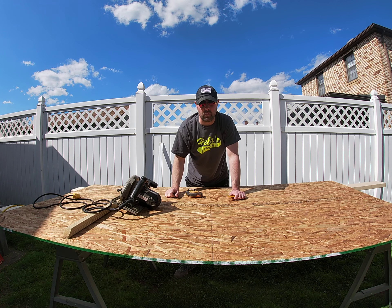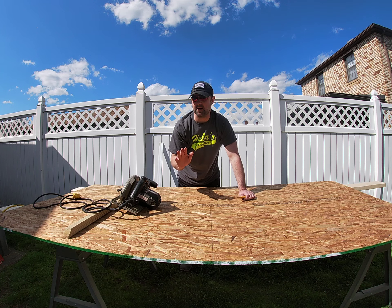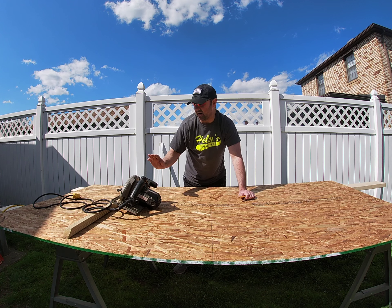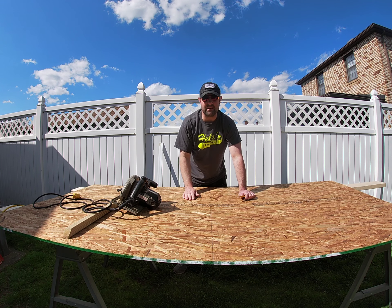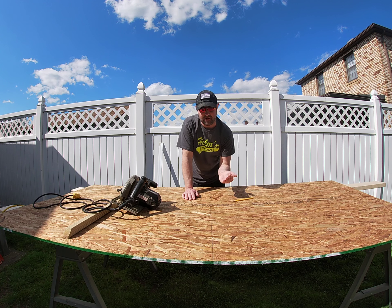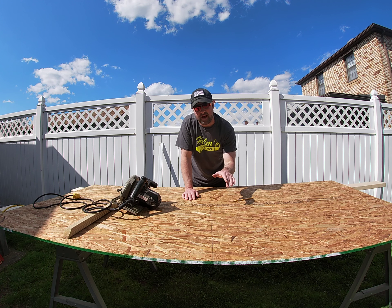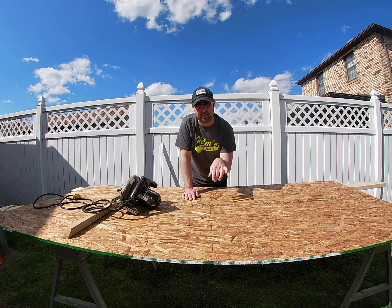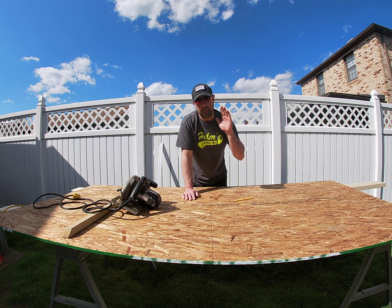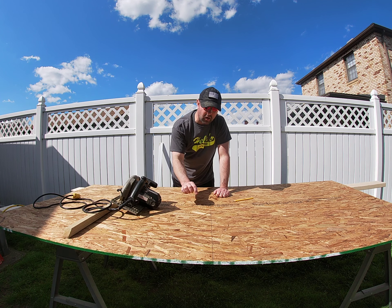So I'm going to mark this, and there are a couple of ways you can do that. I brought a couple of tools — this is a drywall T-square. If you don't have one, a straight edge will work fine. Another thing you could use is a chalk line. It has string and you fill it up with chalk, and when you pull it tight and snap it, it puts a line down on whatever you're cutting. Get creative — there's no need to run to the store if you have something straight.